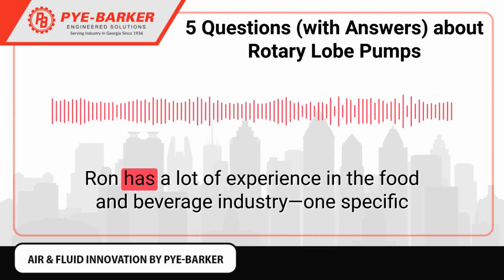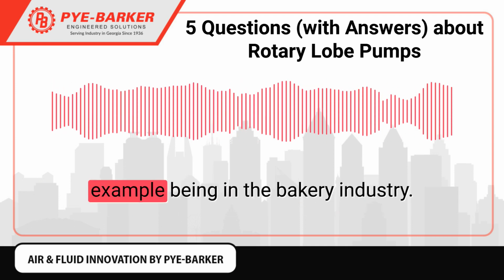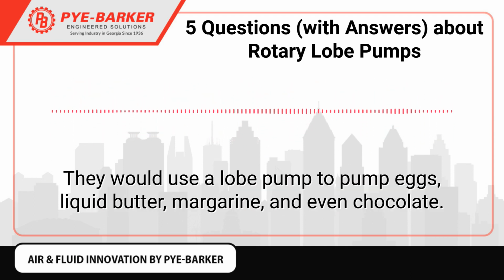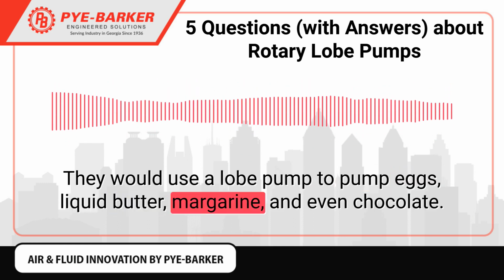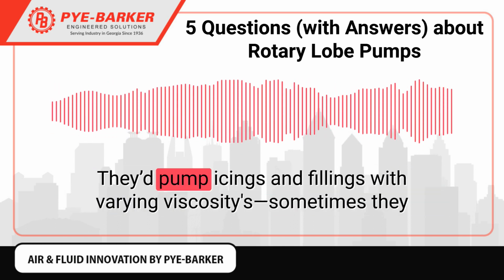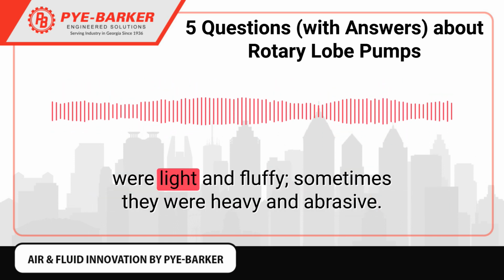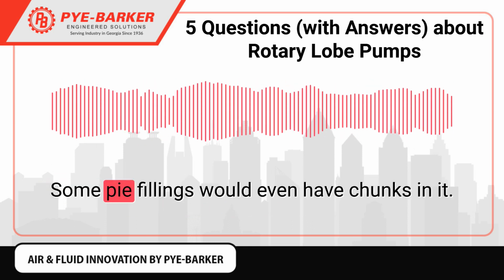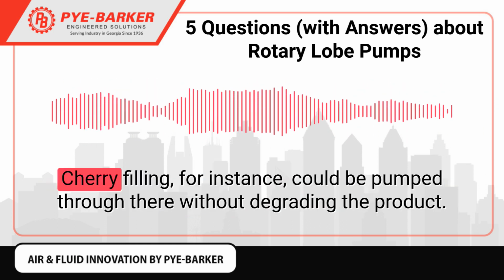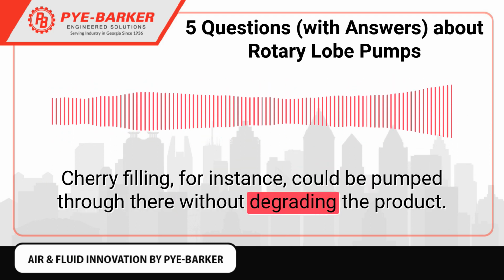Ron has a lot of experience in the food and beverage industry. One specific example being in the bakery industry. They would use a lobe pump to pump eggs, liquid butter, margarine, and even chocolate. They'd pump icings and fillings with varying viscosities. Sometimes they were light and fluffy. Sometimes they were heavy and abrasive. Some pie fillings would even have chunks in it. Cherry filling, for instance, could be pumped through there without degrading the product.